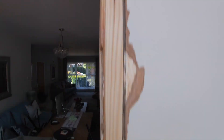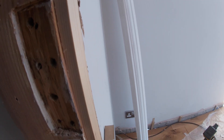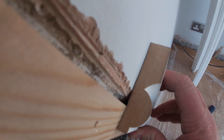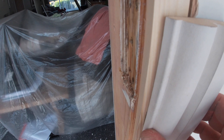The plant-on piece is now fixed — you can see it going all the way around. You can see what I mean by the little quirk; it's created a little step in there, and it looks a lot neater than trying to join two pieces of timber, especially when you've got one old and one new. Now the architrave sits a lot nicer on the frame and to the wall — you can see there's no gaps. I've also marked our quirk again all the way around, so now the architrave is going to sit to that line and create a little double step effect.